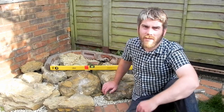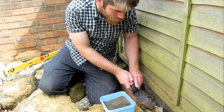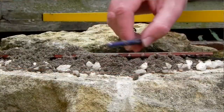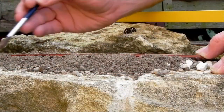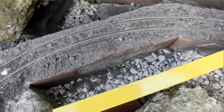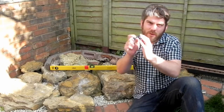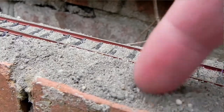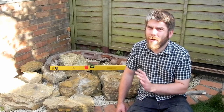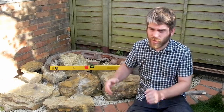So I had planned just to use sharp sand and cement and obviously water — the water you put on after you've laid it down. But it didn't work for me. I think this went wrong because my sand was slightly damp to start with. It dried out before I'd had the chance to wet it all down. So rather than everything locking together, I just had little grains drying out. It's just crumbly powder — I can just sweep it off and start again. But I need to think about how I can avoid it going wrong again. I think what I need to do is just put it on in really small sections.